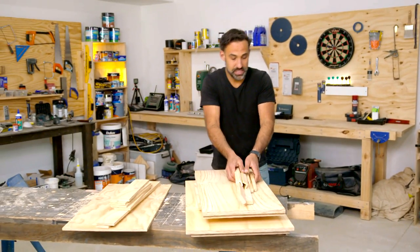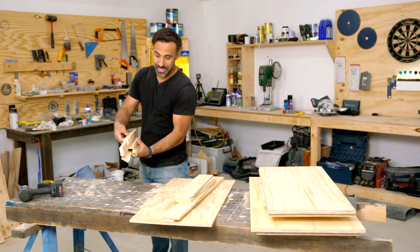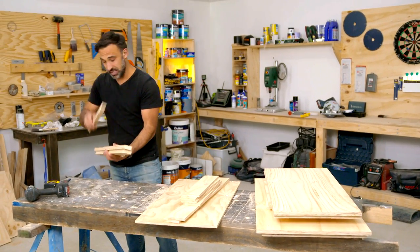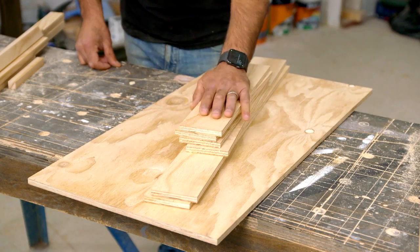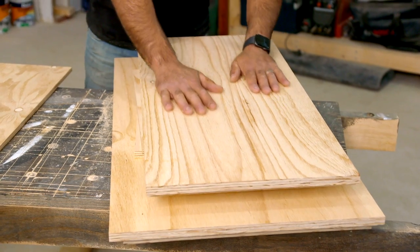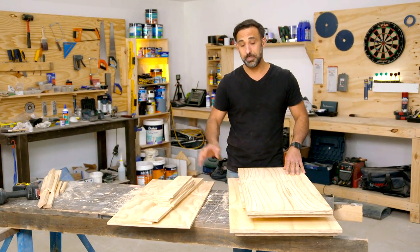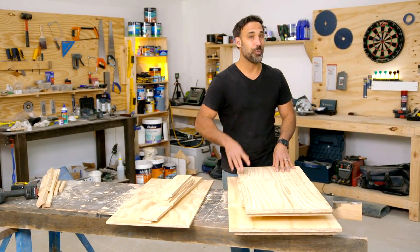That's all our pieces cut. With these bits, they're going to brace the inside of the box, plus dress up our corners with these external edges. This 12mm ply here, that's for the tray that will sit inside, and then these bits are going to be our main box. So now I can go over all these bits and pre-drill my holes where all my fixings go.